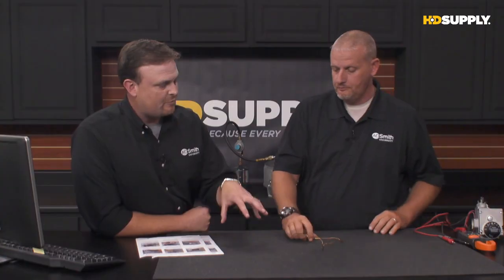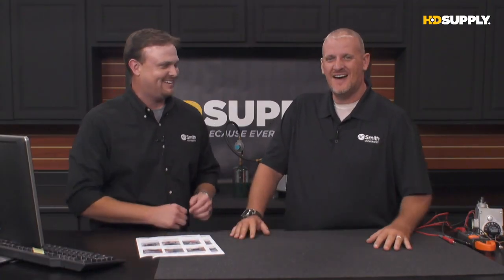So if we have below 10 millivolts, we're looking at the thermocouple. You need to replace the thermocouple. Now, if you have below 10 millivolts, that's the thermocouple, but if you have above 10 millivolts, it'll be the gas valve. That's right. If you're still having that same issue.